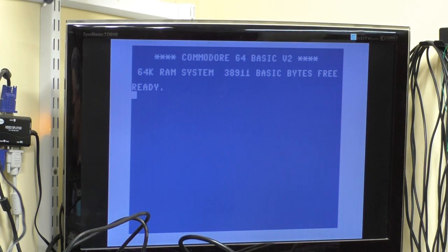Okay, I've got you pointed at the screen, and I'm going to turn the drive on. The head does jog back and forth. Just like before, we got a green power LED, the red LED on solid on the drive. And I think that's okay according to the manual. As I recall, it said as long as it wasn't flashing. Now I will turn on the Commodore. And the drive jogged again. That seems like a good sign. It must be seeing the computer or it saw the reset.